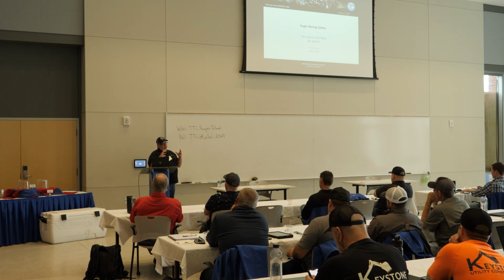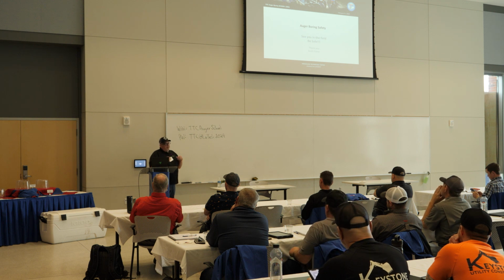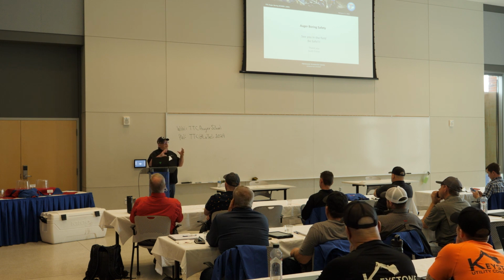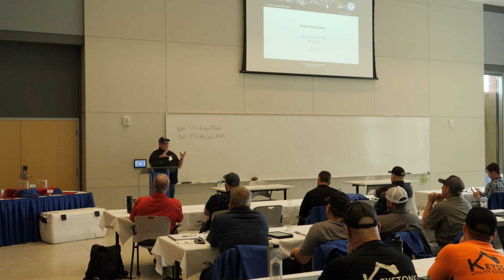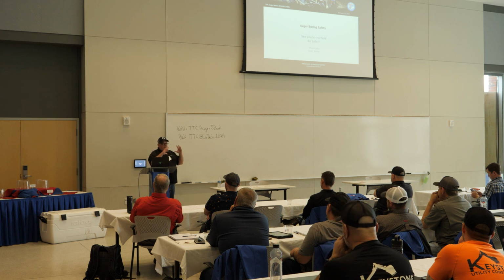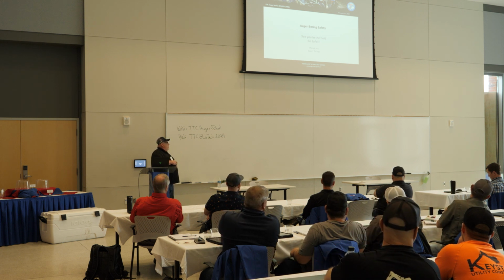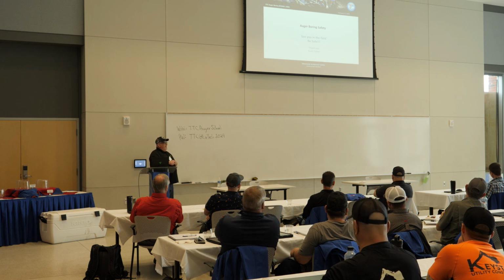I tell everybody, we put half-inch space around augers, so they don't have too much room to spike. Now, we'll still get tight in the case if you use Barbco, not necessarily below the auger. So when you step augers, and a lot of people step augers, I don't have a problem when you step one size. If you start going down too far, you just got to be cautious. If you interrupt the cut or something, you're getting those torque spikes. And it doesn't always happen, but that auger can expand even more because it has more room to expand. So just be cautious of all that. And it's not any fun when you blow an auger tube out and you got to crawl up in there and pull it out and get it out.